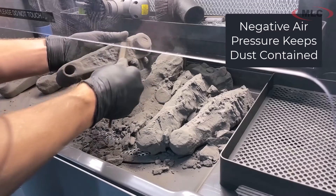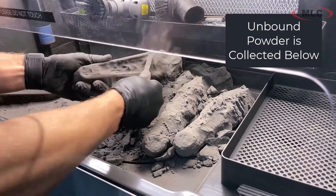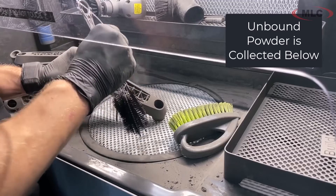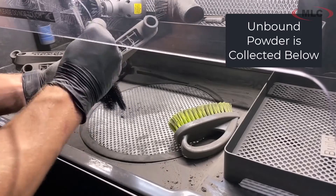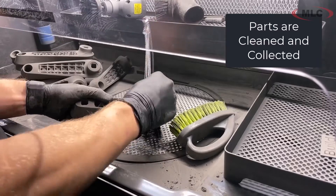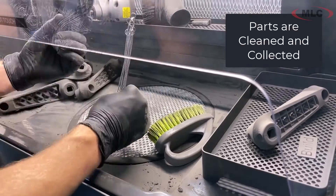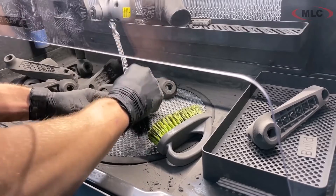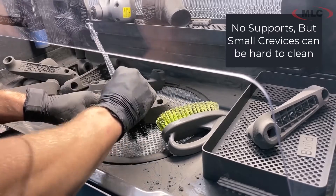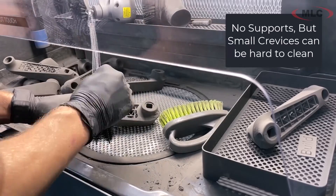The sift itself has a sift floor, and what you're doing is pulling these parts out like an archaeologist, taking all the powder off of them. Anything that didn't get bound gets collected down through the sift and then gets recycled in the next run, so you're not wasting material in large volumes. There are no supports to remove, but you do have to get powder out of the crevices — and these lattice structures were kind of a pain. It's an amazing process, but just keep in mind that instead of worrying about overhangs and fine features, you're talking about encapsulated areas that you can't brush out.